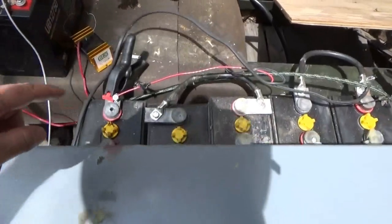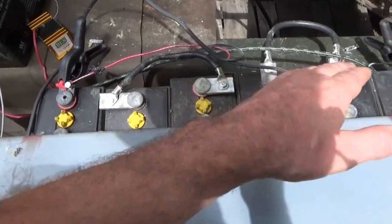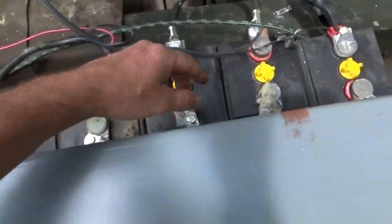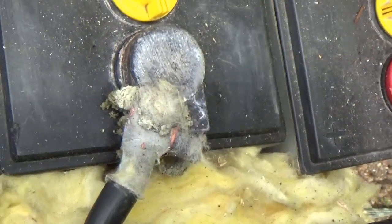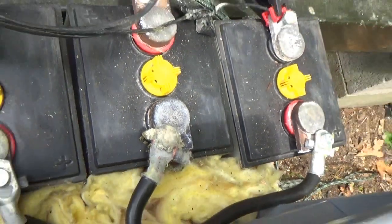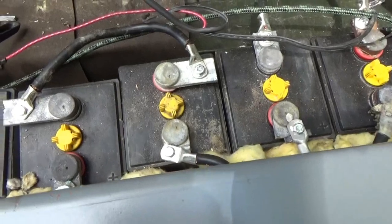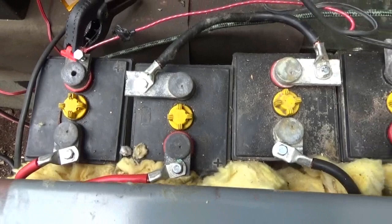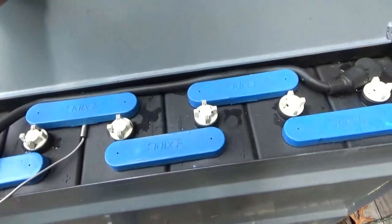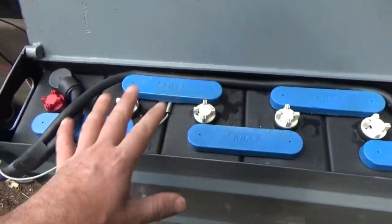The secondary battery bank needs some charging. I need water — I don't know how, but although these weren't hooked up they're low on water. And look at that, there's corrosion — there's corrosion, although there was no use. They weren't in use; I don't know, they boiled off. You can see here, probably just from the heat in the air causing them to boil off, and there's corrosion. I've got to go get distilled water later on in town, and I've been checking the fluids — I put some in but I'm a little bit low yet.